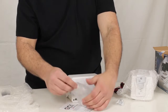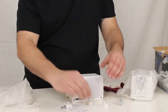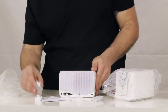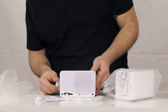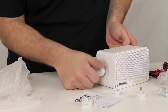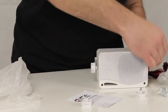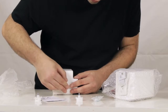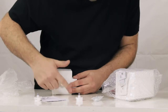In the package, you're going to get four universal mounting bolts. These are hand-threaded and are what will physically attach the speaker to the housing itself. You would line those up and thread them into the side. Once threaded, that's what secures the unit to the U-shaped bracket and allows you to physically pitch it wherever you need it to be.